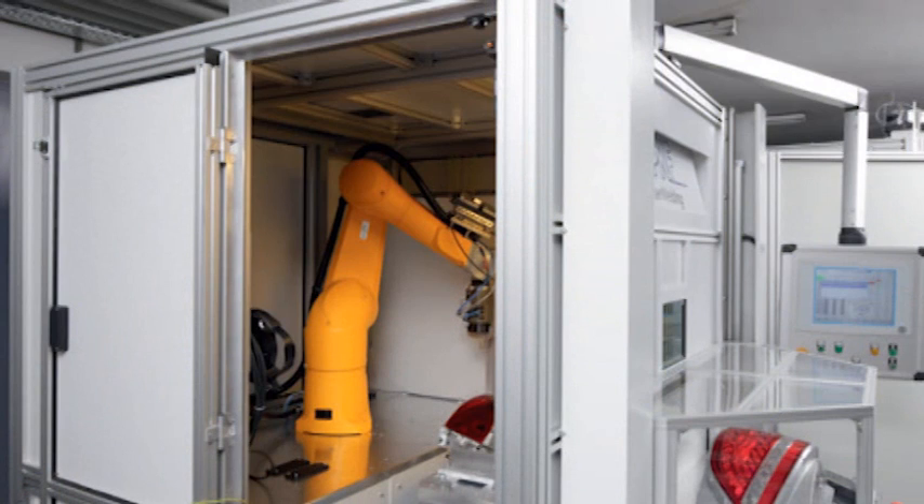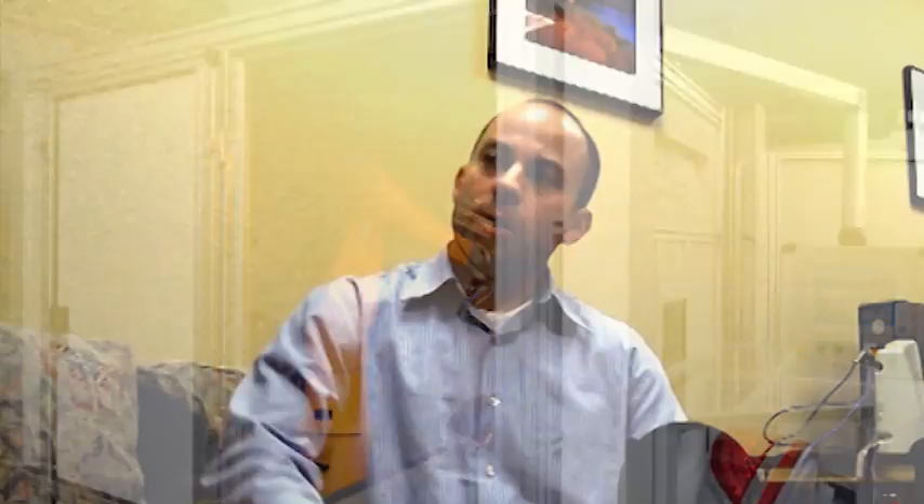Basically, the process and systems had to be adapted to be able to accept these larger full freeform tail lights. Standard 2D laser welding systems typically fit within a refrigerator-sized envelope — roughly five to six feet high by about three feet wide by about three feet deep. When you involve a robot, that obviously needs a much larger space. In order to adapt the robot and accept the larger size parts, we had to develop a new structure surrounding the laser welder so that we could offer a complete laser class one safe environment that houses both the robot and the support systems.